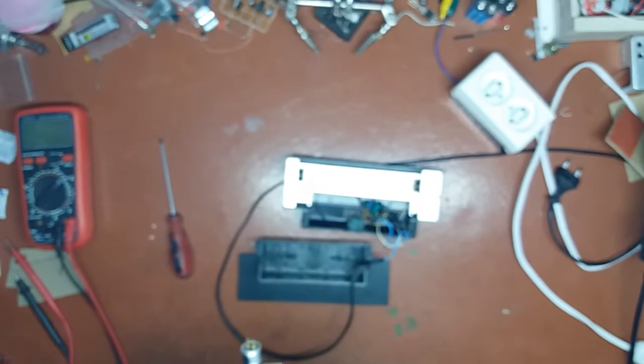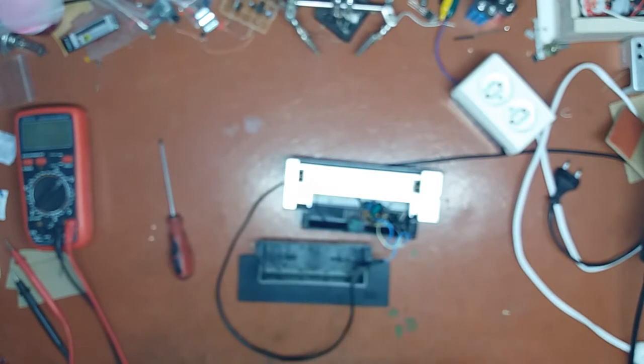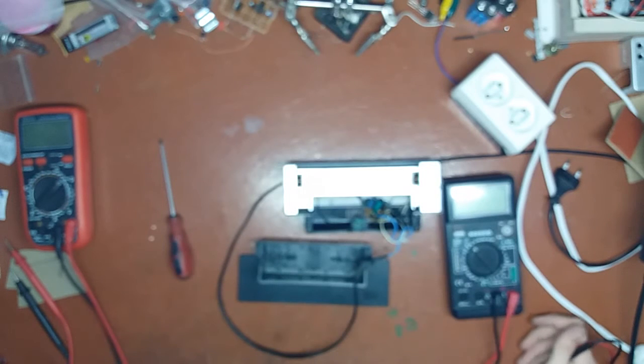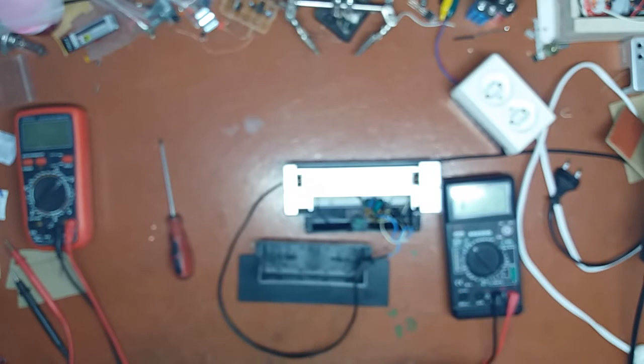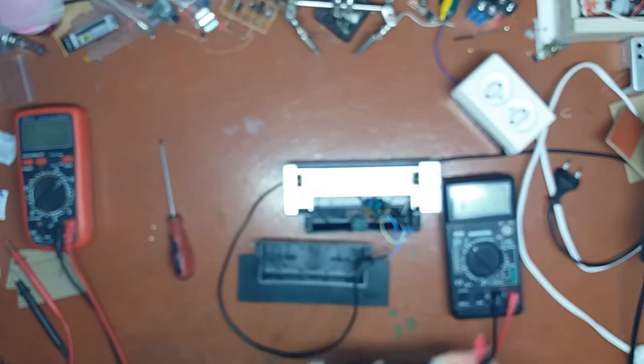Take it out. Do not take the tube apart, it contains mercury. This contains mercury, not mercury vapor. And that is why it takes them so long to warm up and reach their maximum brightness. Because mercury is there to increase the efficiency, to increase the brightness that it puts out, increase the luminance of the tube.